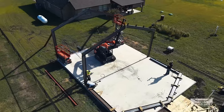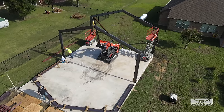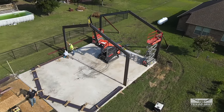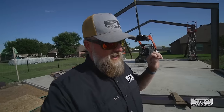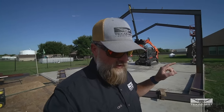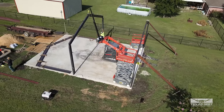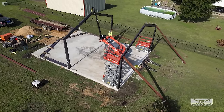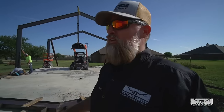That is number two standing up and it's going pretty good. It's only 9:30 and we've got our second beam standing up, so our first bay is going to be completed. Overall, we're moving along pretty good. That's one of the things that helps — when we're able to go ahead and fabricate the steel the day before, that pretty much gives you an advantage the next day when you're trying to stand it up, because all you've got to do is focus on standing it up and securing everything off. That's really the preferred way to go about it.